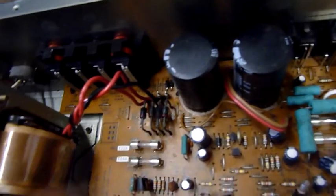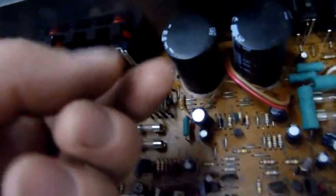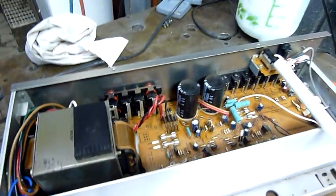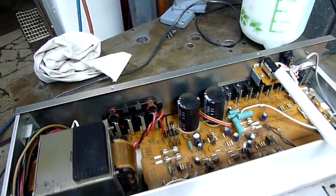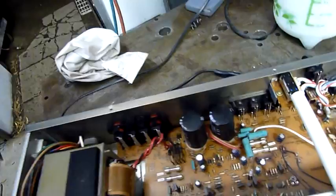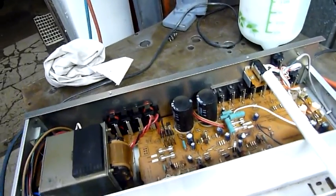It's interesting that whatever that is, I don't know if it's water. Yeah, it could be electrolyte. We might have a capacitor issue, so let's turn it over, take the bottom off and desolder those 2 caps. I'm curious as to what that is spilt in there. It could have come from something at the scrapyard leaking into it, or it could be out of the caps.